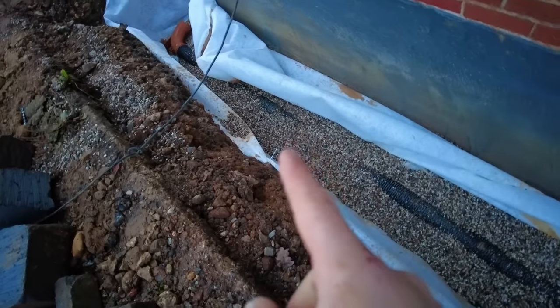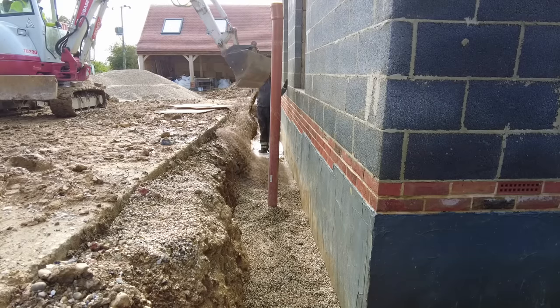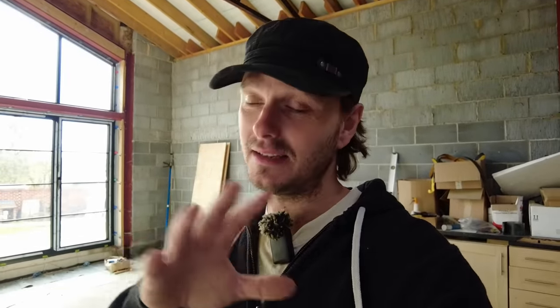From there I put in my actual French drains, and I also did a number of clean-out points just in case, and I put a silt trap on before it then runs off to the actual ditches. Before my foundation was waterproofed and tanked, the water used to come through on the top side, make its way all the way through the building, get trapped inside, and make its way back out the bottom. The reason that was mostly happening is because half the trench blocks weren't actually jointed.